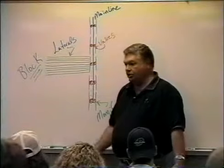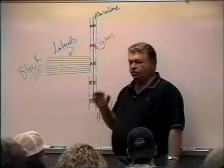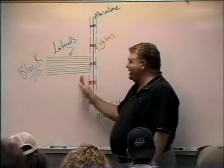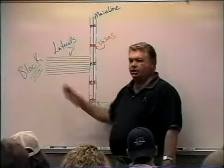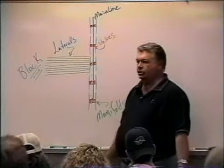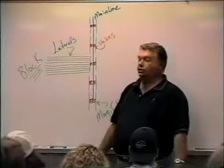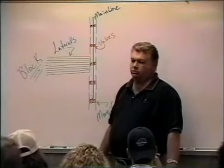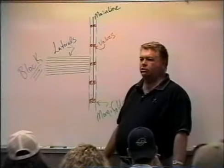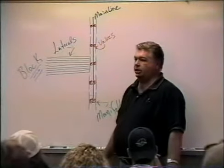The trick is not to downsize so much that you create a friction loss problem. You have to keep the size big enough so you don't have excessive friction loss at any given incremental step down the line. That's a topic for another class — every one of you will be taking a design class and will learn how to do this very well. We'll all be in class together and learn how to do all that sizing, but it takes two weeks to fully understand the hydraulics of all that piping.